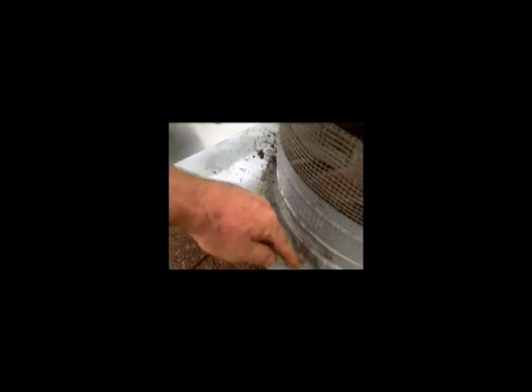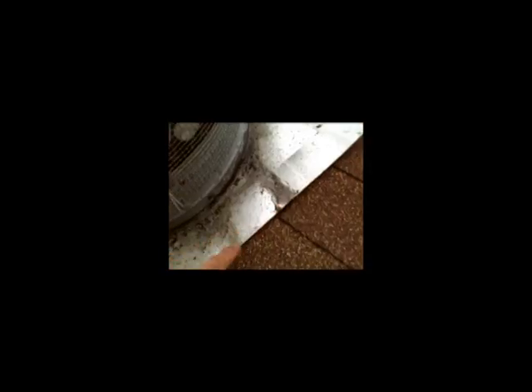And of course, you know what it's worth to be able to sleep at night. World's best static fan — wider flashing so it won't leak, not like these cheap narrow flashings that only have three inches of coverage. Sticks and leaves get in there and dam up right here because the shingles were too tight, so the water ran horizontally. You can see it left a stain over here. So it's important to leave a space along the side, especially if you get one of these cheap attic fans with a real narrow flashing.